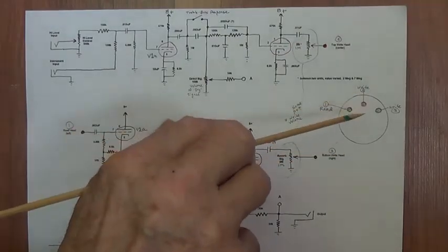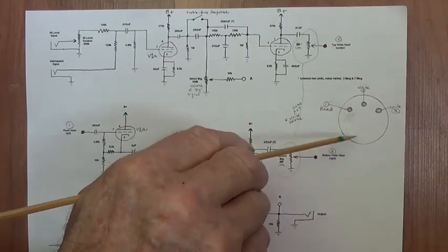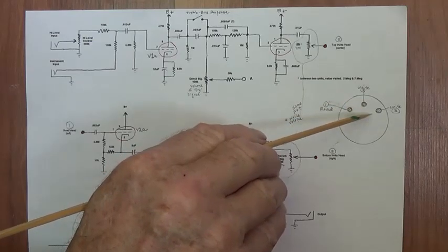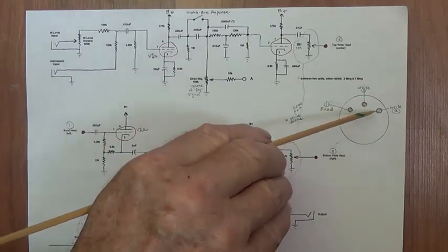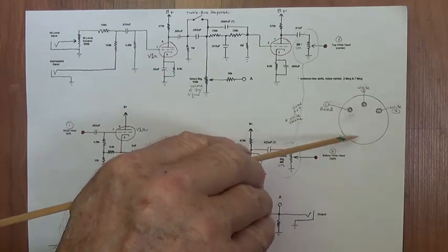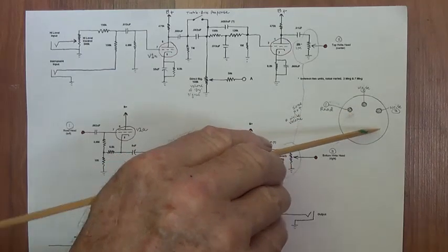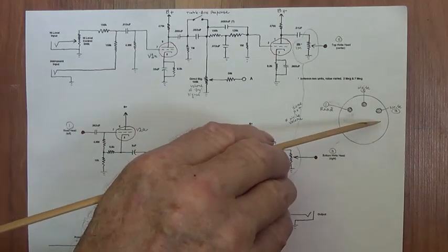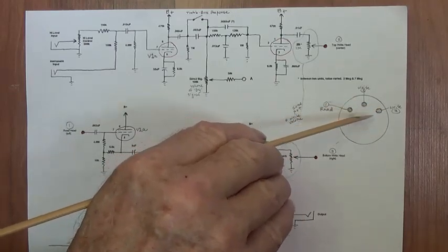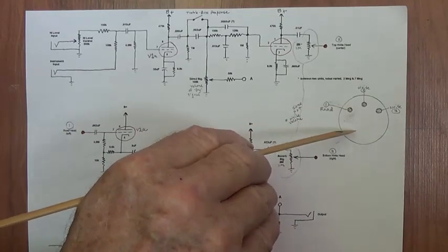Now, as previously mentioned, the electrostatic signals being stored on the disc would quickly dissipate into the air, in fact, probably in a matter of a few milliseconds, if the little carbon granules containing the signal and the surface of the disc were not coated with that U65 Union Carbide oil. That then preserves the signal on the surface of the disc, and it also lubricates between those neoprene heads that are rubbing on the surface of the disc and the disc itself, so that wear does not occur. You can imagine if this disc were spinning dry against those rubber heads, that eventually the heads would be able to wear through the anodized coating and the carbon granules, and the disc would be ruined.